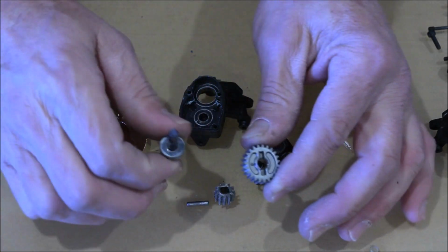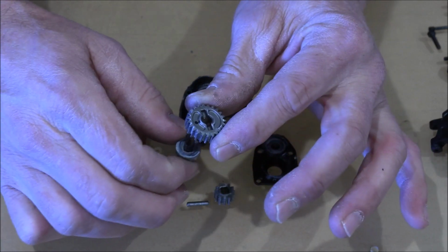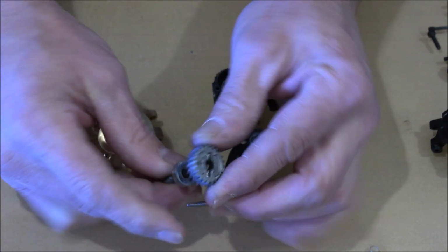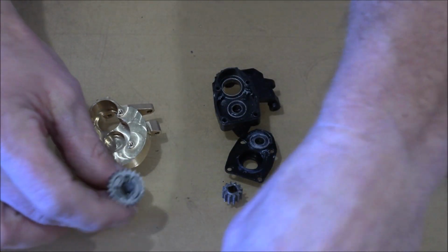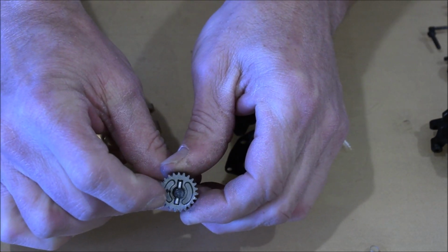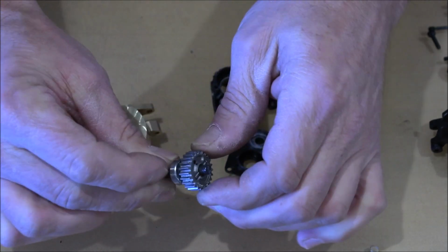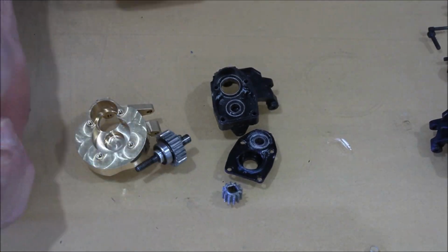And just so you know, as you're putting it back together, the bearing is on the bottom, your threads are on the bottom. This goes on here like this, and then your pin goes in through the top like so, and you pull it tight, and you can see your black mark there. You know that you were in the correct way. That's how it goes. So pay attention to that. Other than that, go ahead and grease the stuff back up and put it back together.